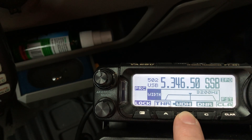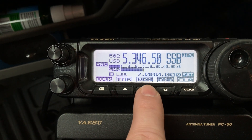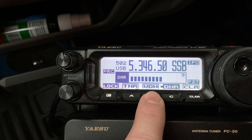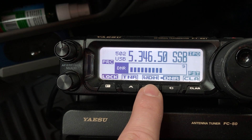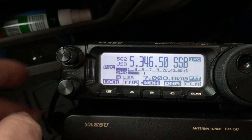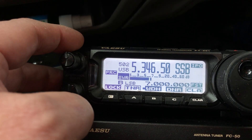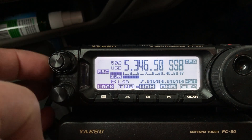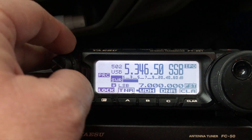So again let me turn all that off. There's what it sounds like with no help. And then now I'll go digital noise reduction. Again, 9 is what I found to be the best setting. It will introduce what sounds like a little bit of an echo effect, but don't worry about that. To me it doesn't bother me at all and it takes away that watery effect. I'm going to put the width back on at 3200. I'm going to press the multi knob to get it back where I can see the signal meter. And the final thing you can do is turn the RF gain back to the left. Now listen to that. See, the RF gain is the final piece in this when working with digital noise reduction.